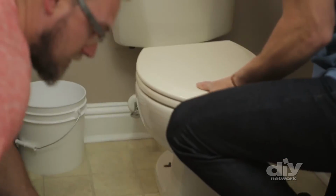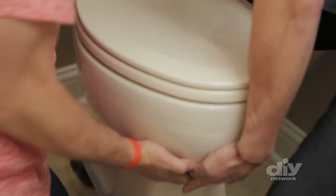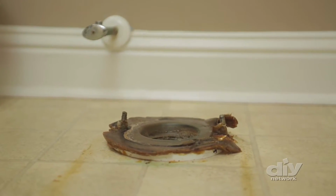All right, buddy. You ready? Yeah. All right, slide that towel out. Okay. And then we just need to rock this back and forth to get it loose. Ready? 1, 2, 3. Oh, okay. Once you have the toilet freed up, go ahead and move it out of the way onto those towels that you laid out. And what you're left with is a pretty nasty looking wax ring.